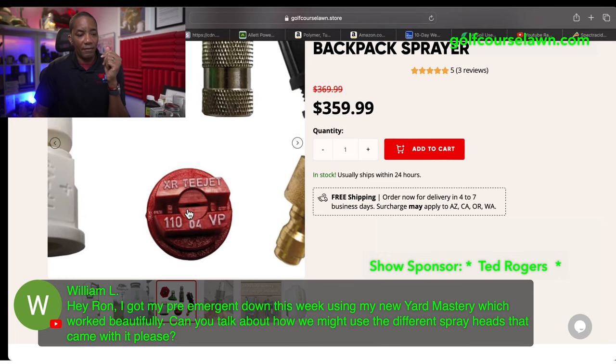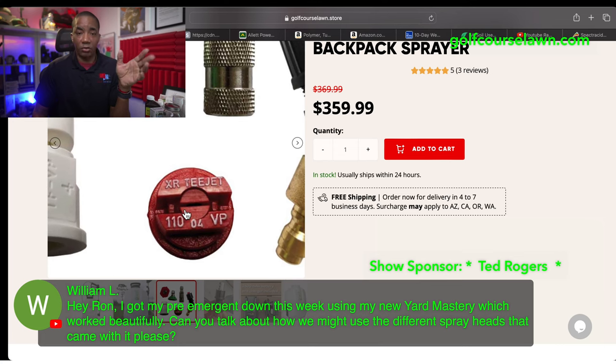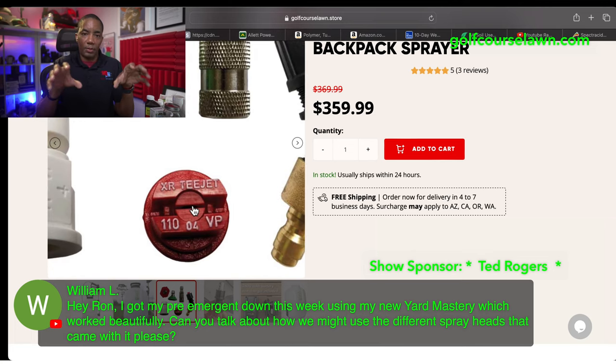And then you have the tip that's going to live on your sprayer most of the time, which is the foliar tip. So between these two, this guy is going to produce a larger droplet size. It's almost going to look like a shower head, like bigger droplets. And this is going to produce finer droplets that are akin more to a mist.